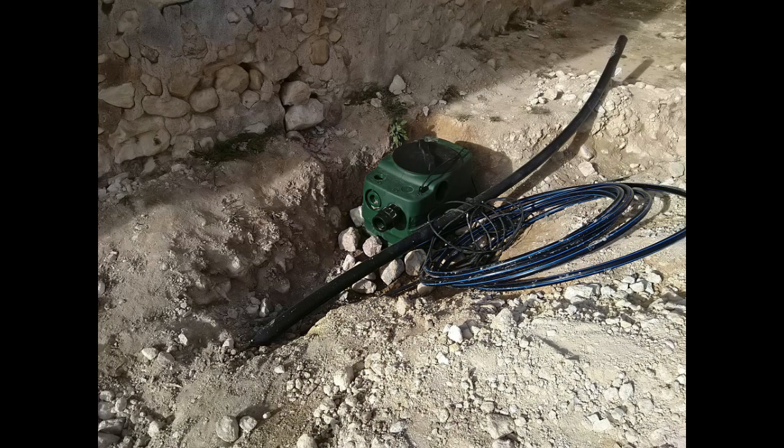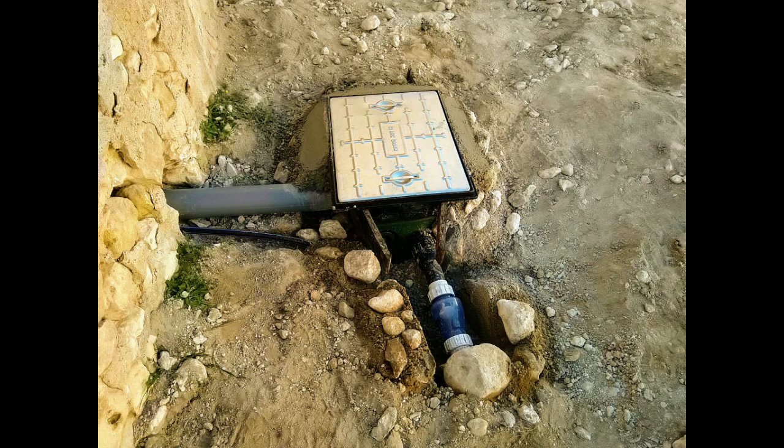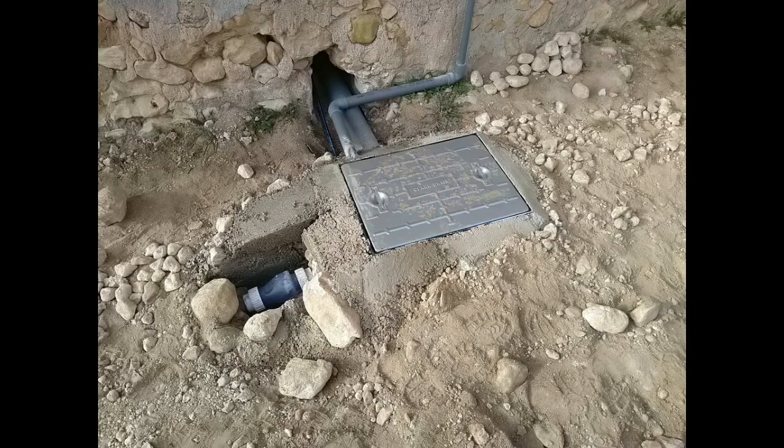We had to have a pumping station because the septic tank is slightly uphill. Here you can see all the pipes in place: the left gray is from the main en-suite bathroom in the main house, the top right gray comes from the utility room waste and the upstairs bathroom in the apartment, and the larger black pipe below center is where it gets pumped up to the septic tank — with a non-return valve on that for obvious reasons. The smaller black pipe on the left is the water supply for the house, and the black on the right is the armored cable.